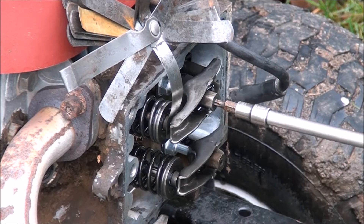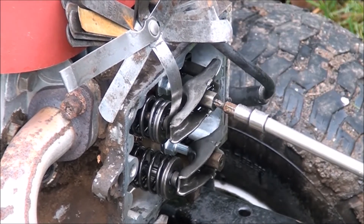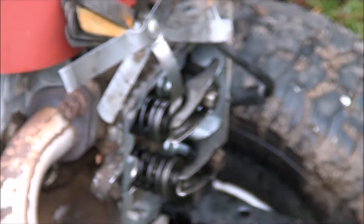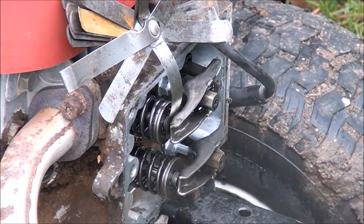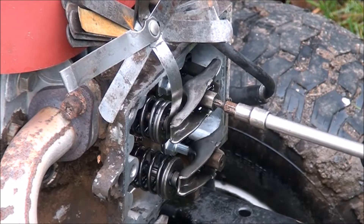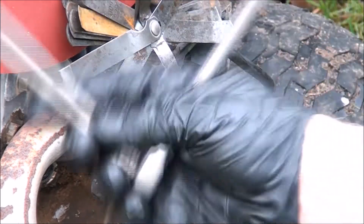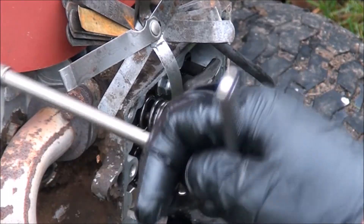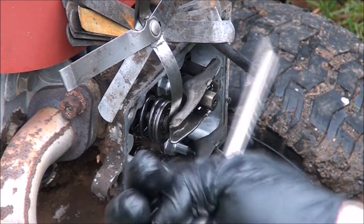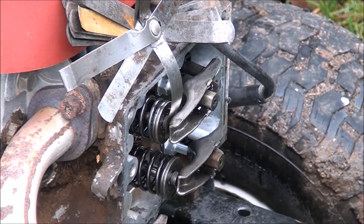This is kind of a tricky part — you have to be very careful when setting this set screw. You have to hold the nut here and the set screw torque is not very much. You lock these down to about 60 inch pounds, so that's just four or five foot pounds — not very much. When you lock those down you're going to want to hold this nut in place. I have a calibrated wrist — basically I just tighten with my wrist, just my forearm. Most people can't generate more than about 6 pounds of torque just by doing that. That's one of the ways I tighten bolts that have a very low torque spec.